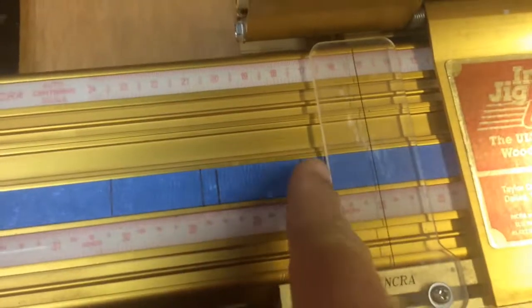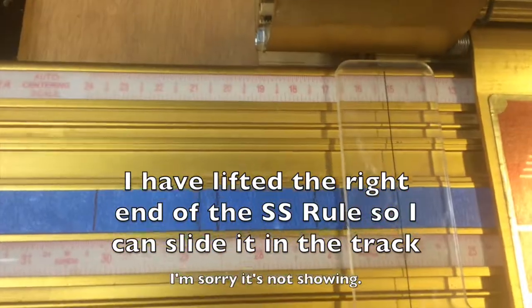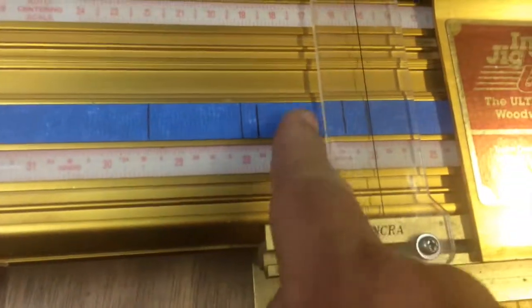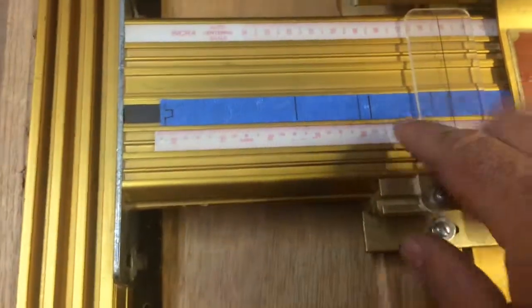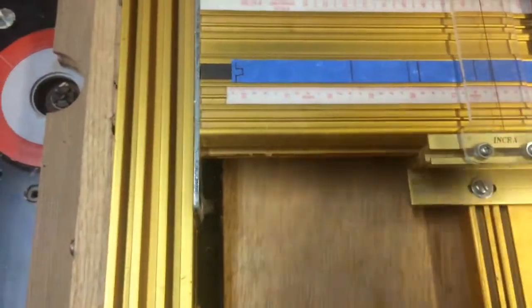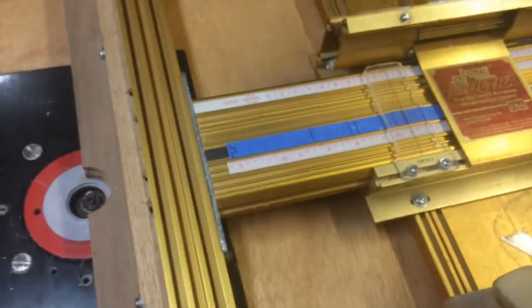First, I return to the zero mark - the zero mark's here at the plexi - lock my gate in, confirm that this is in fact centered on the blade. Now I'm going to grab the scale again and move my zero mark under the hairline. Because I do not like having to try to remember to line up to this side, I try to be on the hairline each time. So that's the secret to the customized templates - make your marks using this as a guide, and then slide the whole thing so you can use your hairline. Now I'm set up and ready to go. I'll be able to zip to each one of these locations, run my stock, and have perfect reduplication each time.